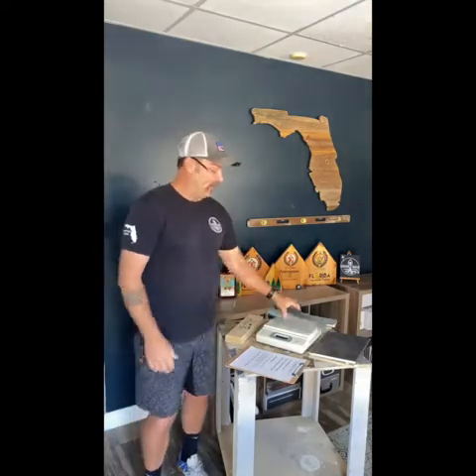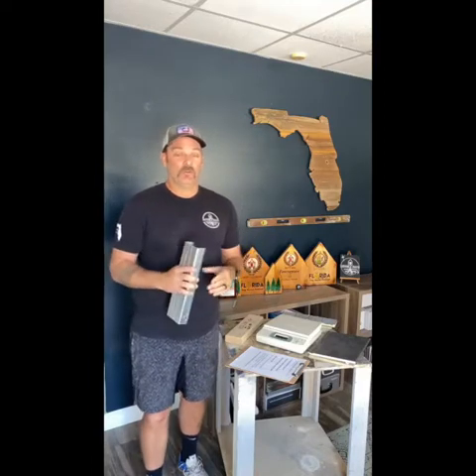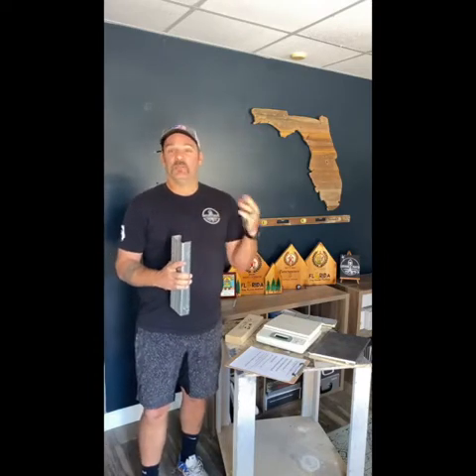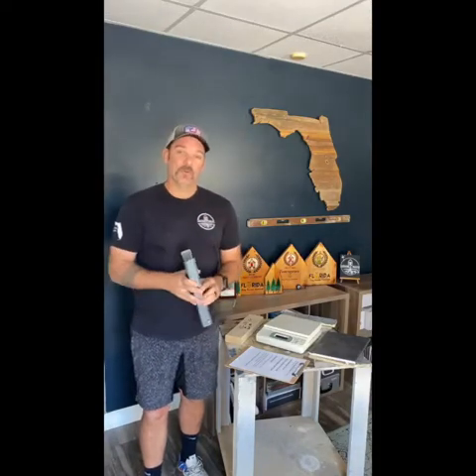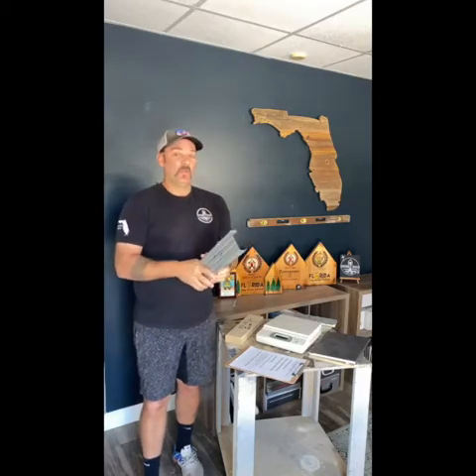Another pro: its quality is predictable. The machine prints this out and it's going to be nice and straight, which is something we're always looking for when building a home. You want your material straight so your walls are straight — that way you can hang cabinetry and not have crazy bows in your walls. It doesn't warp or bow like wood.